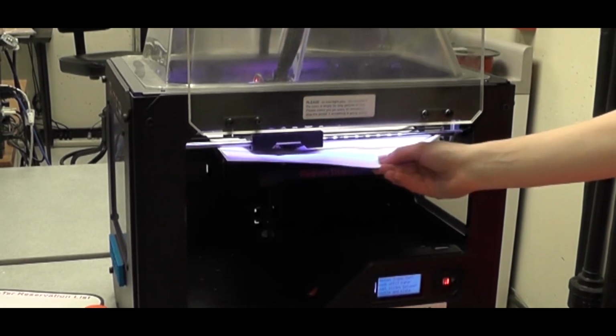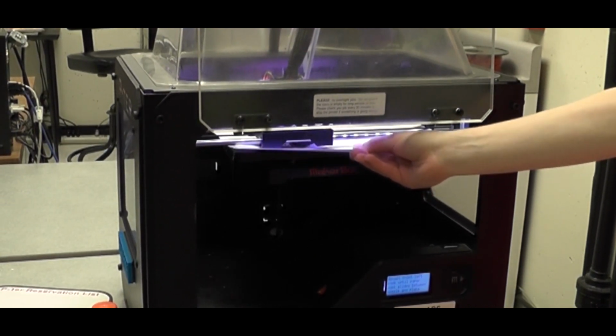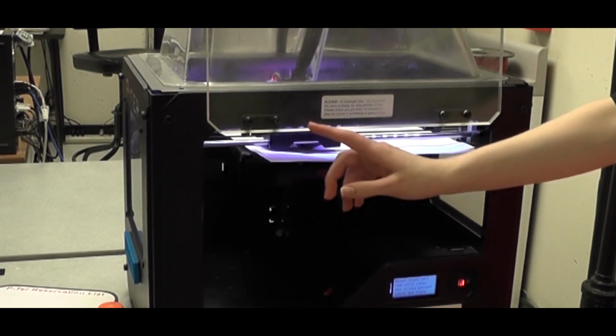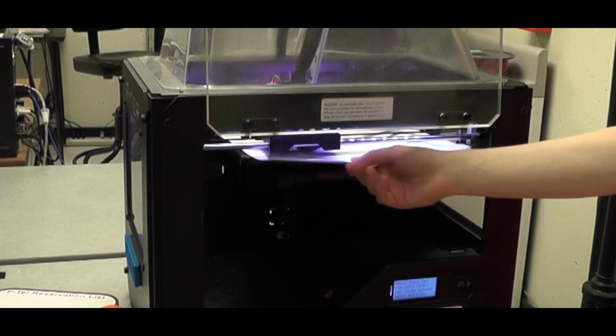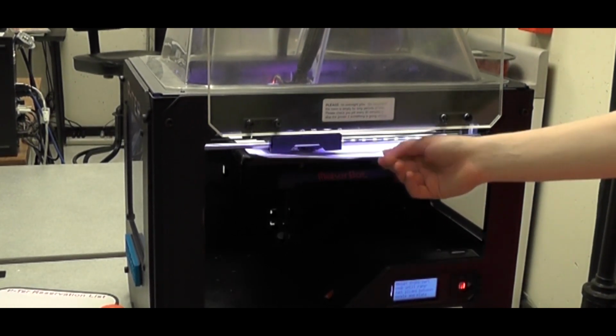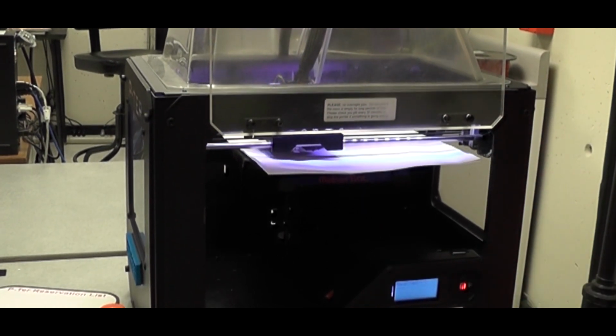This knob, on the contrary, has a lot less friction than we would want. So go to the knob directly underneath the extruder and tighten it just slightly. I would say that this amount of friction is sufficient. Once completed, press the M.